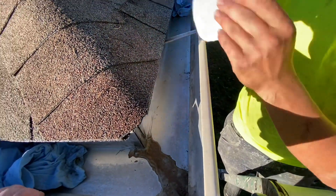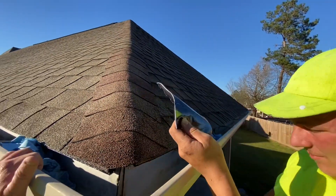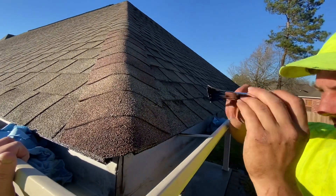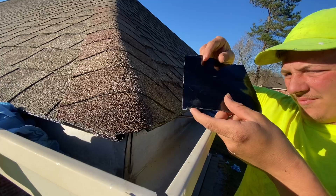This product is a gutter tape, six inches in width. It usually comes in about a 25-foot roll so you can do a lot of houses with it. These are $30 per repair. So if you keep this on your truck you can repair a leaky gutter in a few minutes — $30 per repair.